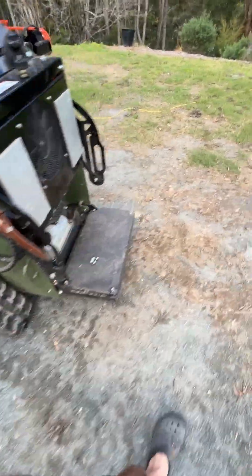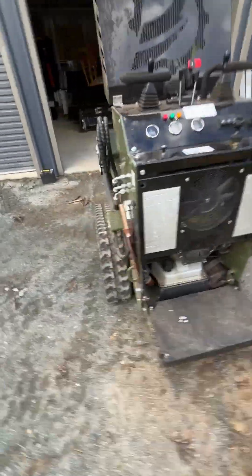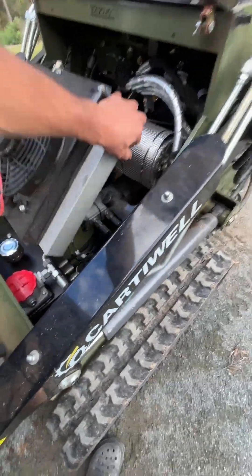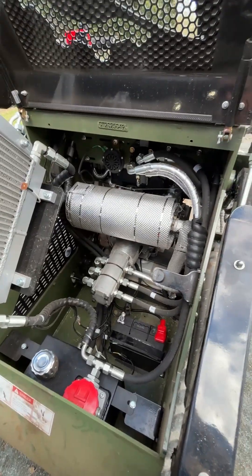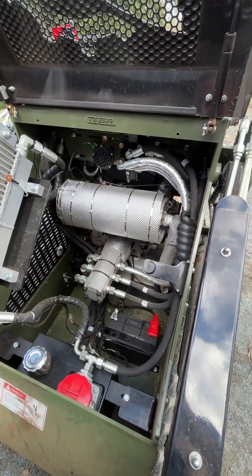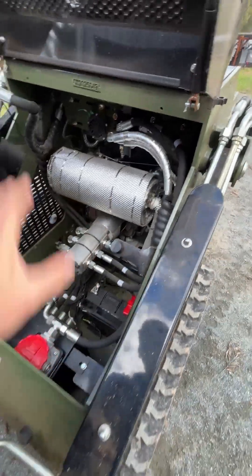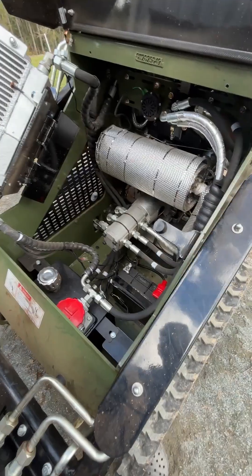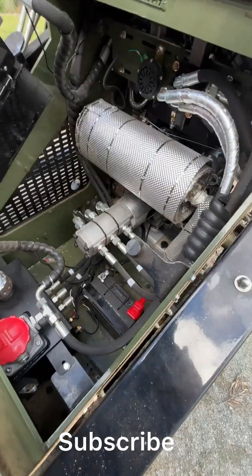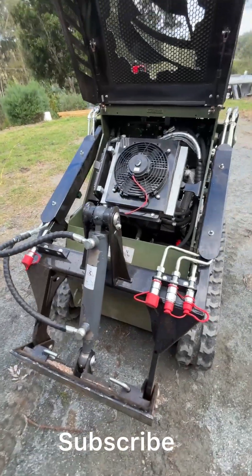So that's basically why I've done this. I hope it helps. I'm sure you've all got your own systems — I see a lot of guys stick a fan on the side blowing in, but I'd really like to see them sucking air out, trying to create as low a pressure in and around the work area as possible. The whole design is counterintuitive and probably wrong. I think maybe the motor should be here with the pump out the other way and a large hydraulic tank at the back, so the exhaust has a chance to run heat out through the top of the hood rather than locking it in under all the controls. But this is what we've got to work with — let's try and make it work the best we can.